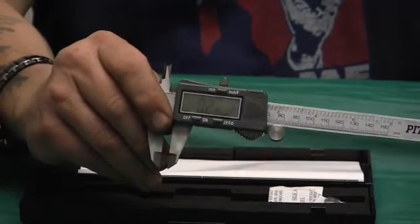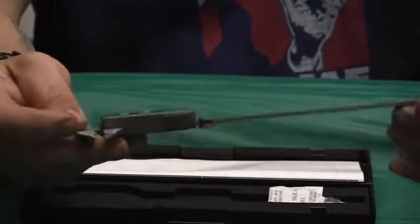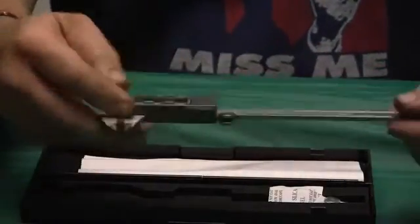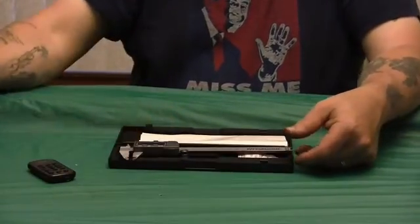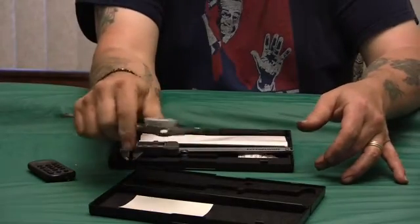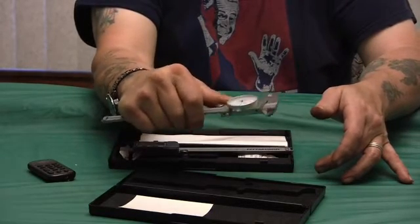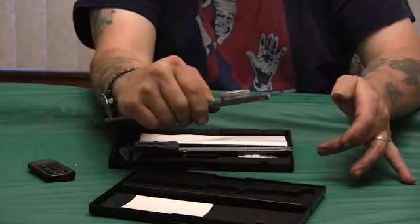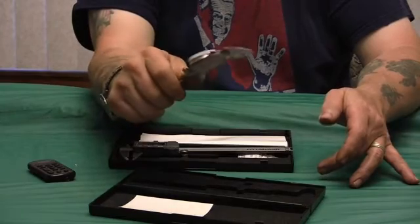I mean, if the thing's going to act goofy on you and not be there, yeah, it's 10 bucks, you know, if you can get by with what you're doing with 5 thousandths. I don't like these. I don't recommend them. You could go and get for like 25 bucks, just the plain Jane ones with a covered way and a gear rack in there. These repeat fine, within a couple tenths. And if you're careful with these, and they cost 25 bucks, they're a better thing.